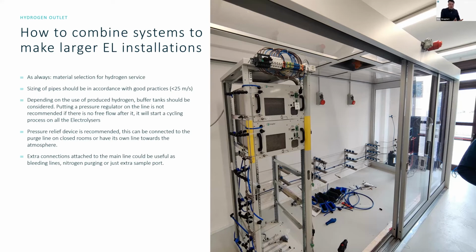If you have an air-cooled system and you put it very far up on a mountain, then of course there will be a difference in air density, and the air will not be able to carry as much heat away from your system because you're putting less mass flow through it. So that's something to be considered. You probably have a higher cooling demand at that point. But if you deploy the system in the correct ambient conditions, for example at 25 degrees Celsius, and make sure it always stays there, then you will have very little problems with this.